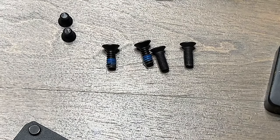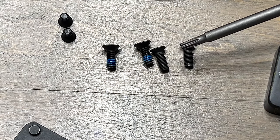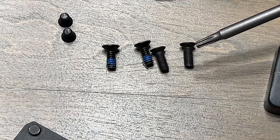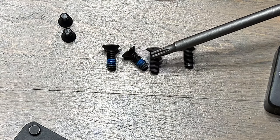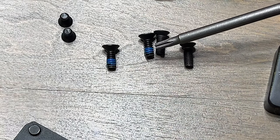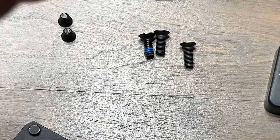I'm gonna show you a close-up right here. These are the original Springfield screws — I think it's like a 6-28 or 6-48, I don't remember off the top of my head — but these are the ones that work for the original plate in the actual gun, they thread directly on there. Now this thread pitch — you see the difference — this one with the blue loctite, this is the one that fits the new optics plate.